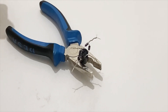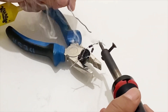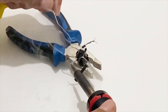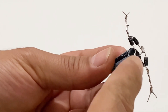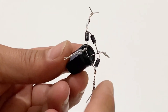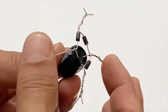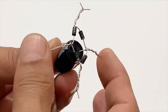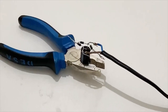I'm going to solder the connections of the diodes as well. I've connected the negative poles of the capacitor to the negative poles of the diodes and the positive poles of the capacitor to the positive poles of the diodes. These two pins will be our output and these two pins will be the AC input. Now I will solder the output connections.